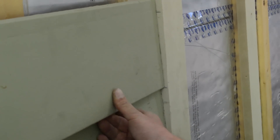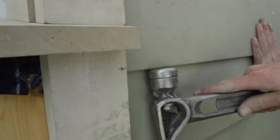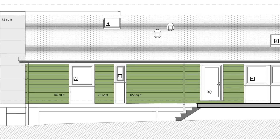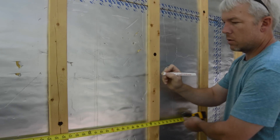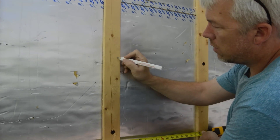The storyboard marks were transferred onto each piece of vertical trim. The marks represent the bottom of each course of siding. A couple of long sections will require more than one piece of siding to cover the wall. David decides on a joint pattern and makes notes on the strapping as to which pieces he'll start each course with.